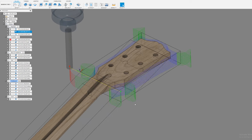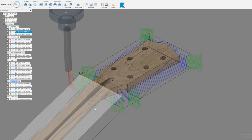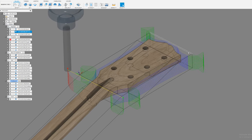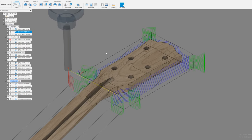So when you're attacking at these angles, the machine has inherent flex, right? So when you're attacking at these angles, you make these smooth contours where it comes in and out of the cut, and you get a much more precise cut like that. A lot of people think you just run this machine and slam it to the next corner and slam it to the next corner. Every time you do that, you get a little bit of chatter, a little bit of flex. If you cut really slowly, you can avoid it, but this is 200 inches per minute that I'm cutting here on this.